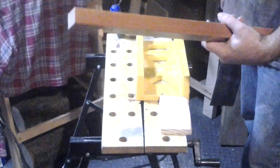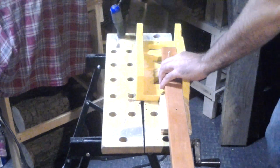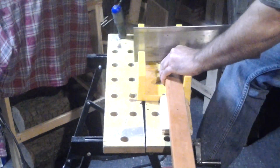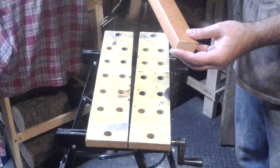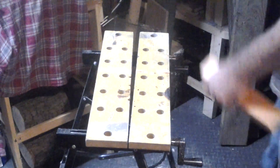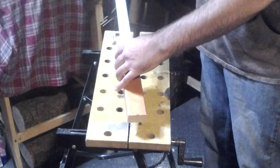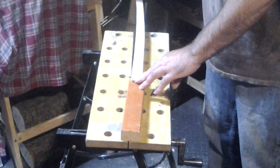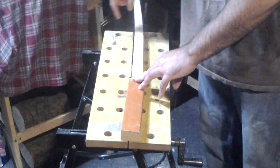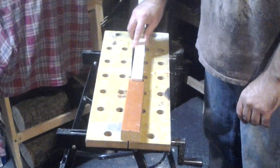It's time to work on the handle. We've got this piece — I think it's cherry. I'll put it in our miter box here and cut it to length with a back saw. We've got the piece for the handle cut off. So what we need to do is fit the blade to the handle. What I plan on doing is sinking the handle in with the blade in the slot, yay far, and gluing it in place, trying to maintain this angle throughout the handle so it has a little arc in it also. Or I might just keep it straight — we'll see how it goes and see how badly I screw up mounting it.